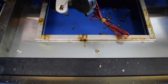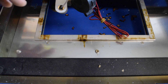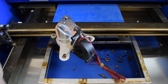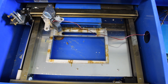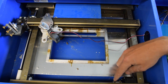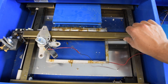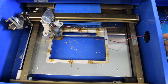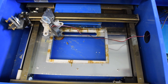Maybe I can remove that frame right now as well. I'm going to guess that every piece in this machine is insanely important because it's built to such a low price, but I'm going to try removing it anyway. As it turns out, the rail down here was only there to cover up the axis for the stepper mount which moves in the Y direction - I was actually wondering where that was. So now it can move pretty much all the way. I routed the wire through this hole in the side - not sure why it's there, maybe for a fan. I'm going to need a drag chain sooner or later, but right now that's going to be good enough.